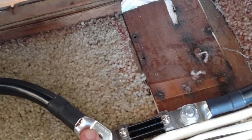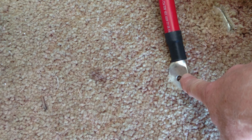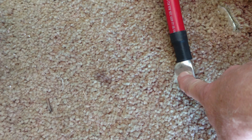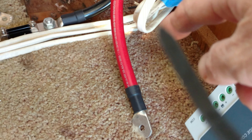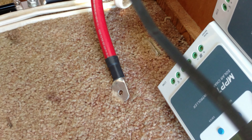There'll be another big cable coming off here that goes to my inverter. So that's positive for the inverter, negative for the inverter. All my other positive things will come from this too. It'll run into this thing, and then a couple little things I want to run — like alarm system and a couple fans — are going to be connected to this little bus bar with these little screws. Those are low-amp things, so this bar takes maybe 100 amps — just for the low-amp stuff.